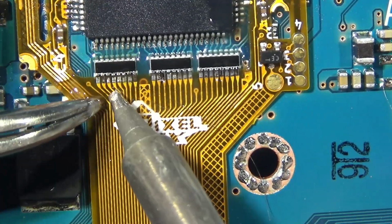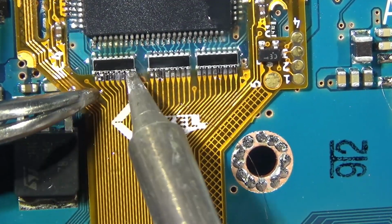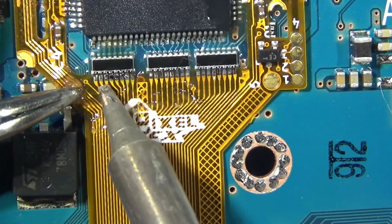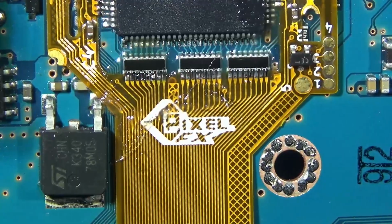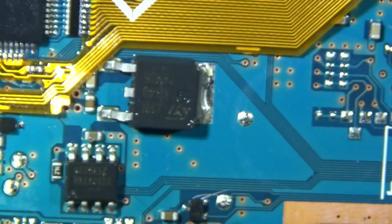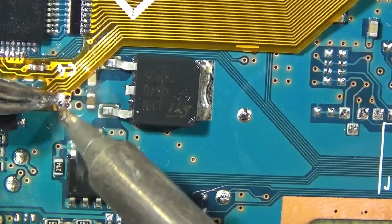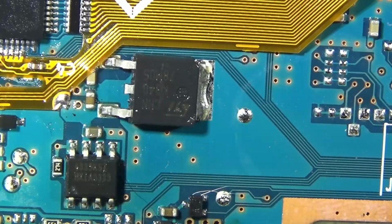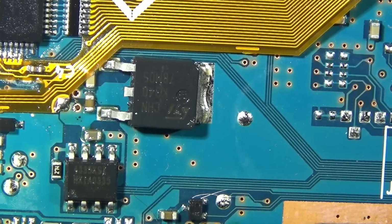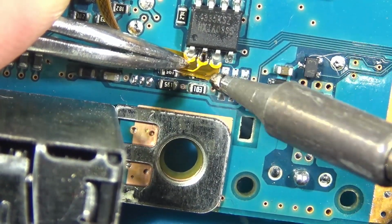You're only going to see me do very light drag soldering for bridge removal. A little drag in there. For the most part, I'm focusing on pins at a time. There it is. That's the via I should have soldered to before. Had to scrape it. It's all good. Totally accessible. Not a problem. The old reach around again. It's all about getting that weird angle and tacking it in.